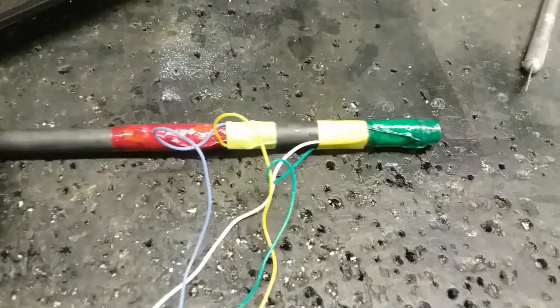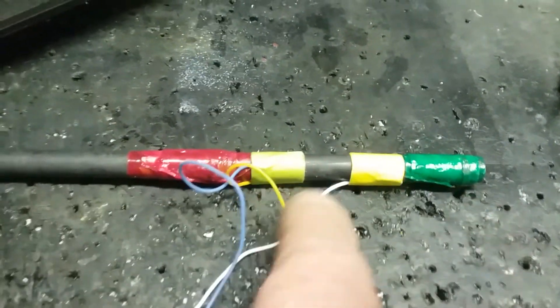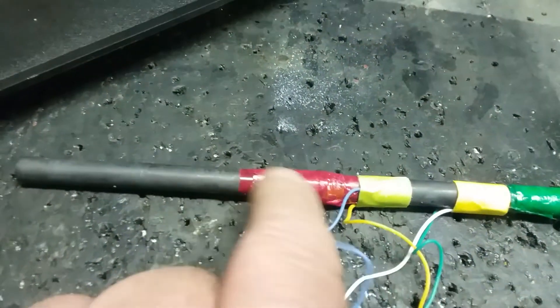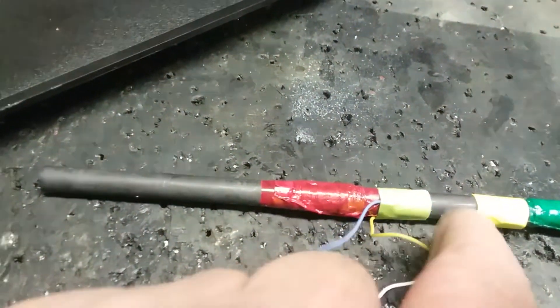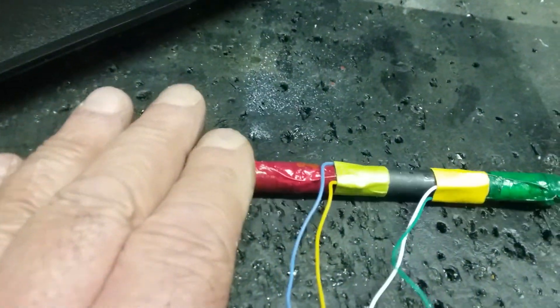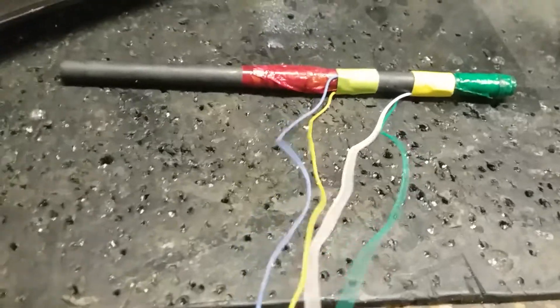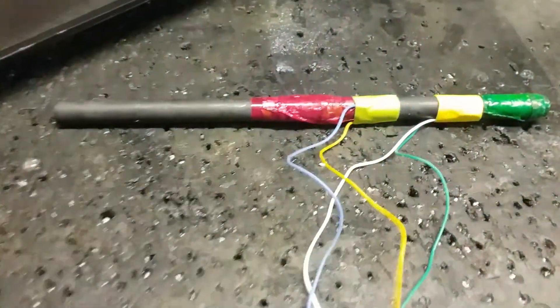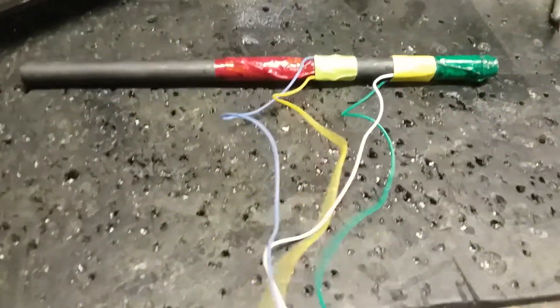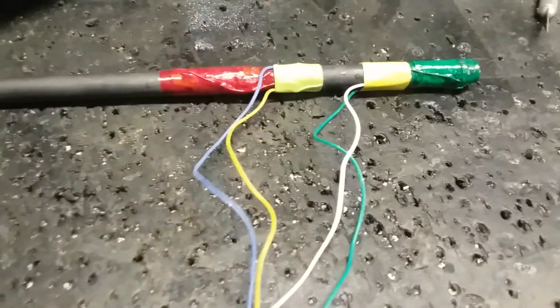That's it — finally getting focus. This is the finished thing. You can see the wires a little better now. Make sure you wrap tape first, then solder to the coil wires. I'm using silicone instrument wire — high-temperature, I believe it's 24 or 26 gauge — really good stuff. It'll take a lot of twisting and it has very fine conductors inside.